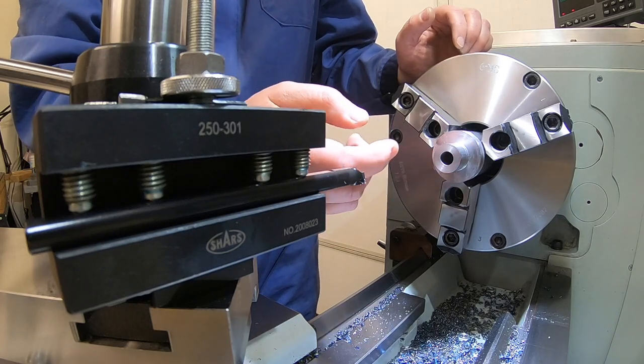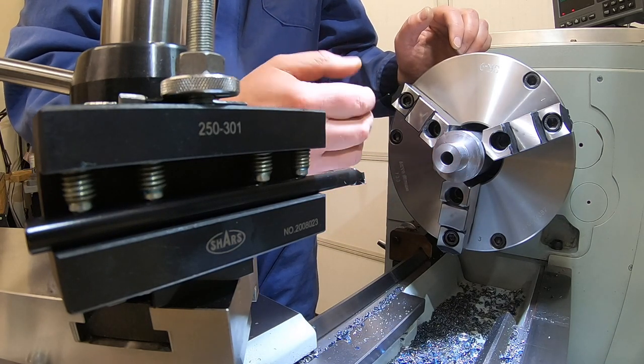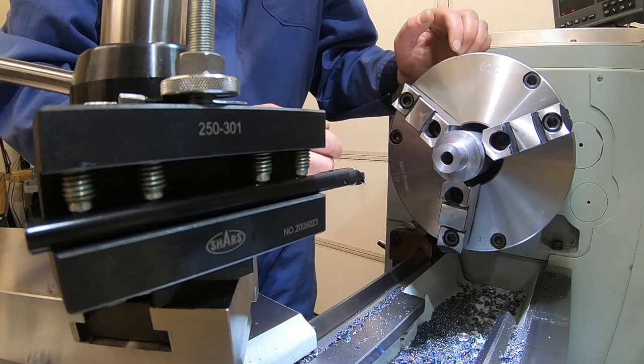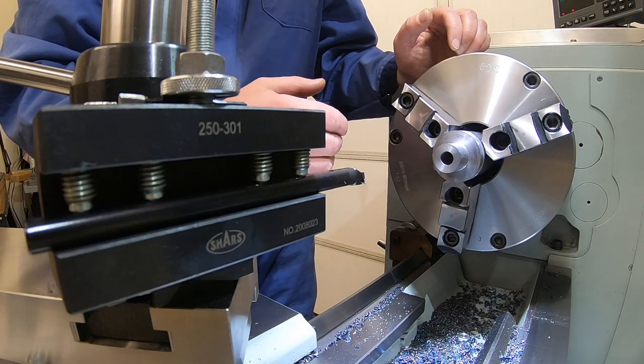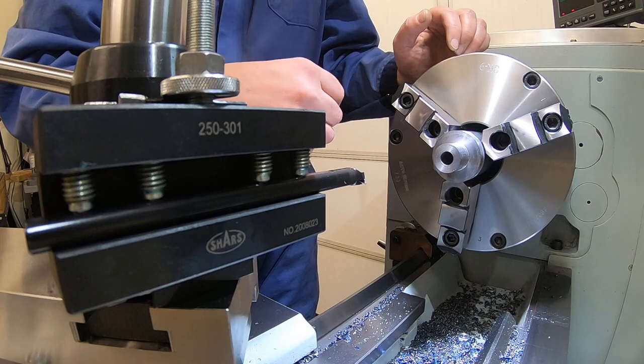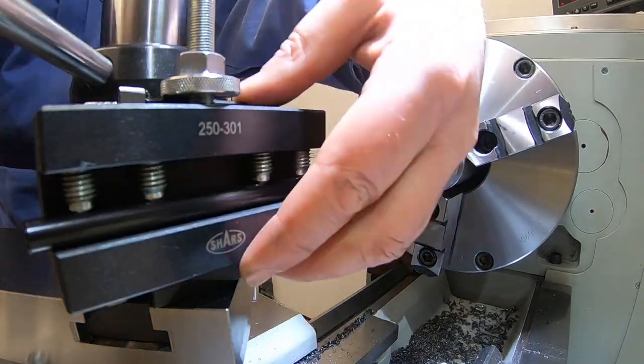Took that first rough cut at 10 thou and how much bar flex out of this new little bar. And should have backed off a little bit and only taken just a skim, a couple thou out of there to see how much flex. Learning the new boring bar. Probably should have slowed down to get that a little more accurate for the piece we're making right now. That's still the same tolerance that was on the existing one on there. That's going to work fine.